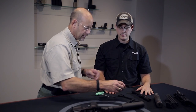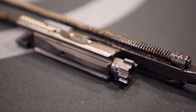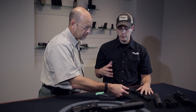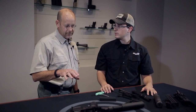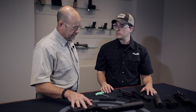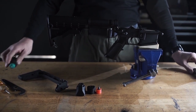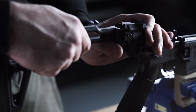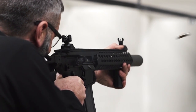Your gas assembly, gas block, and gas piston stay with the barrel. And here you've got basically an AR bolt carrier and AR bolt head. But the recoil management system uses two guide rods and twin recoil springs above the bolt — we basically took the standard AR recoil system, shrunk it down in size, put it on top of the carrier, and call this the carriage assembly now. For guys with a standard AR lower — yes, you can put the MCX upper on a legacy AR-15 lower receiver. We're going to be offering a lower receiver conversion kit that replaces your buffer extension tube with an M1913 Picatinny rail at the back, then you can drop on your MCX upper and get all that modularity.